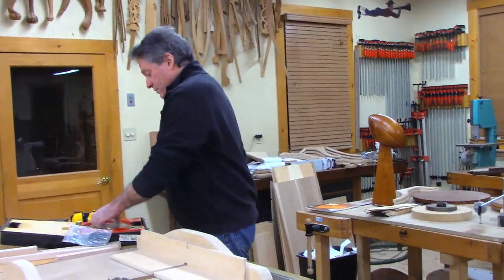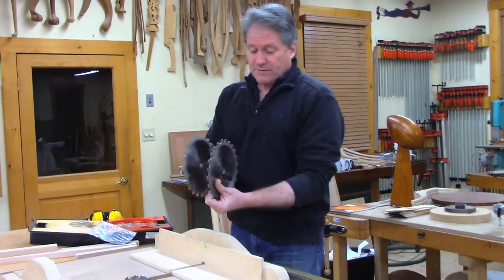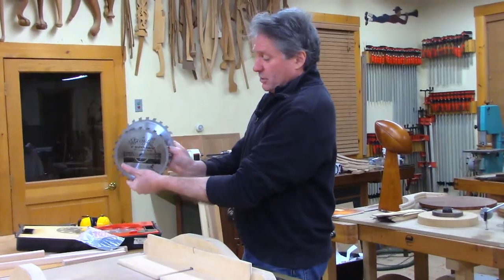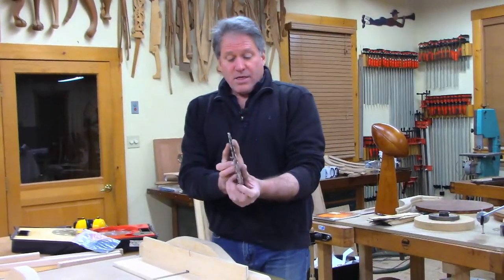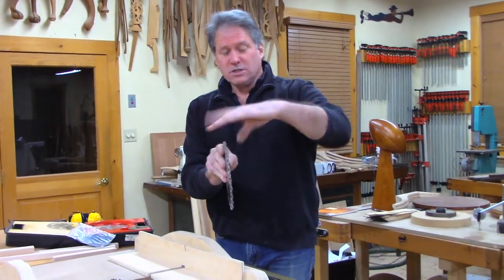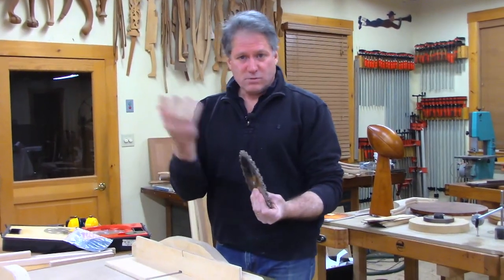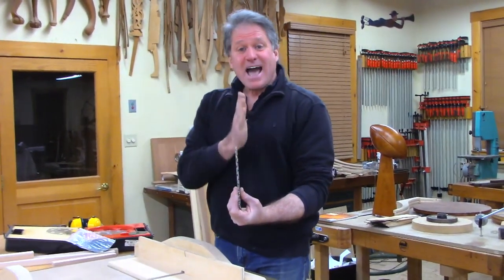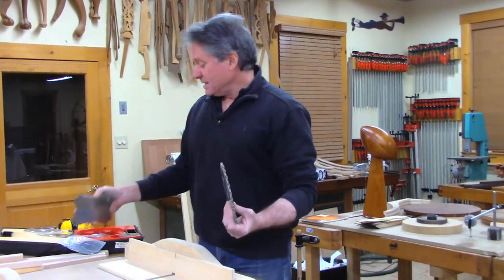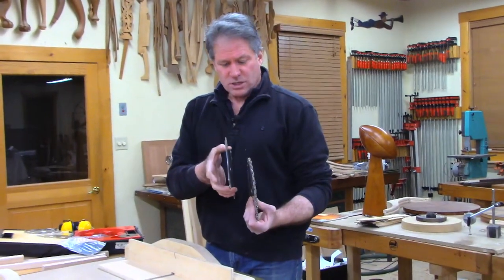And you always get two outside blades. Those have to be positioned with the writing out so that you have your left and your right. And that's the minimum. With the minimum, you've got a quarter inch, so it's basically twice the thickness of your standard carbide blade, which is an eighth. Now you can stack as many filler pieces between them, and you get like four of them that are an eighth inch.